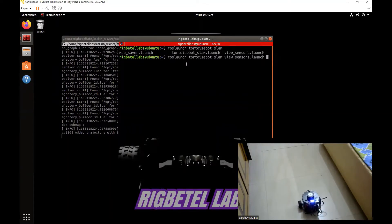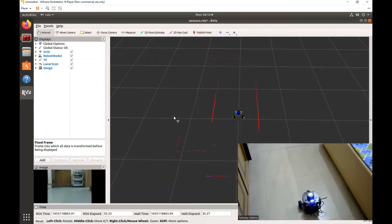First let us run the view sensors demo launch file to view the visualization of what the sensors are perceiving. So now in the RViz window, we can see the LiDAR and the camera visualization. If I put my hand in front of the camera, the camera is obviously going to detect the new images it is receiving. Also to see the LiDAR, let us take this example bottle as an obstacle and place it towards the right of the robot. And as we can see, we have new LiDAR points right over here. If we move this bottle around the robot, we can see the LiDAR points move as well.